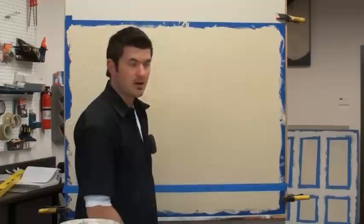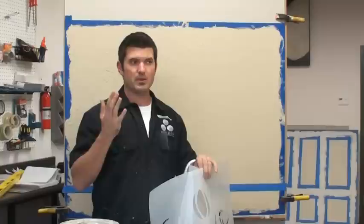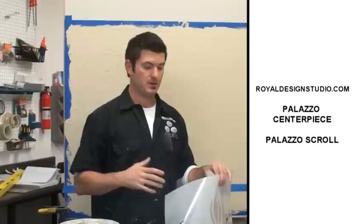My hand-applied Plaster Text is dry. First thing I need to do is go over the top with 220 grit sandpaper. Now we're going to do some embossing - I'm actually going to do a two-layer stencil embossing. I like to do that because a lot of times when you see embossing it's got relief but it doesn't have any multiple depth to it. It's a little trickier and takes longer, but I really like the end result.